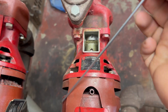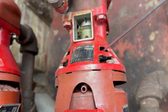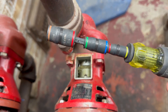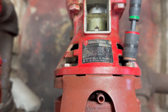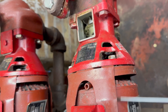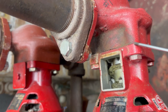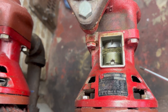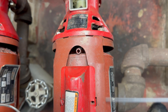You need two tools: a 1/8 Allen key to remove the coupler screws, and a 7/16 nut driver to remove the bolts. Since we are removing just the motor, we have the bearing assembly here - this is the water seal. We are not shutting off any valves because we are not opening the water seal.